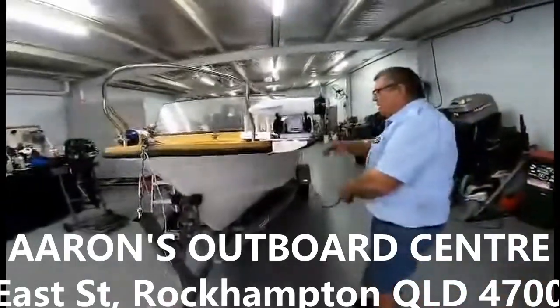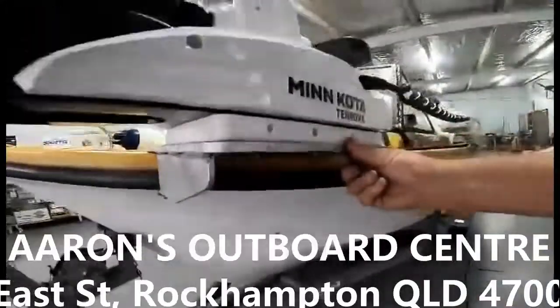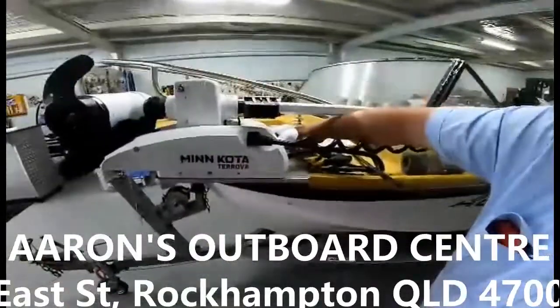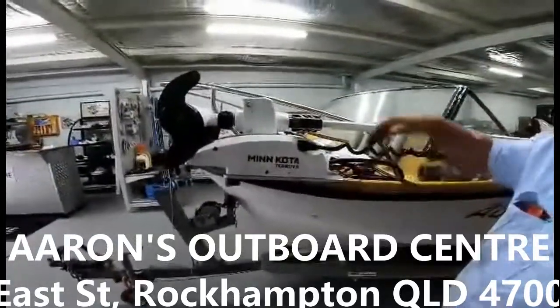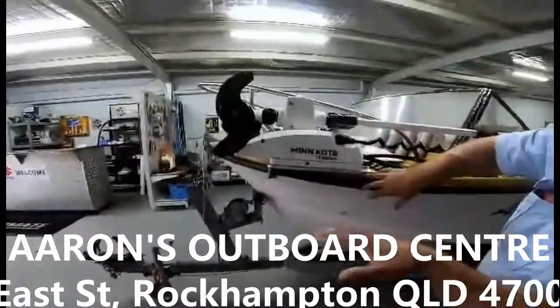Made up a new plate. Wow, look at that, guys. 10 mil aluminium. Positioned it into position, measured under it the different gaps as it proceeded, and made up nylon bushes under it so that it bolts through, so that keeps the line that we want for it. In a flat.